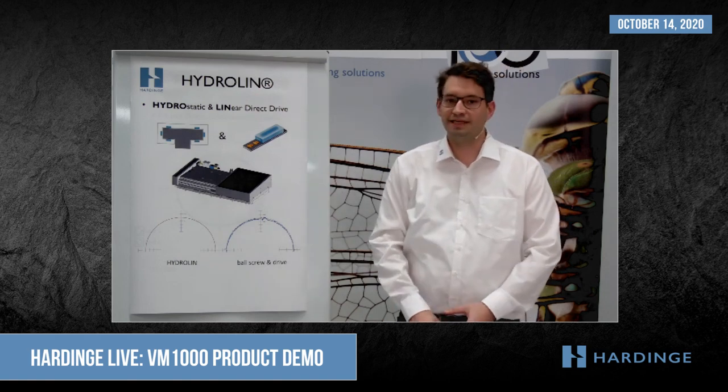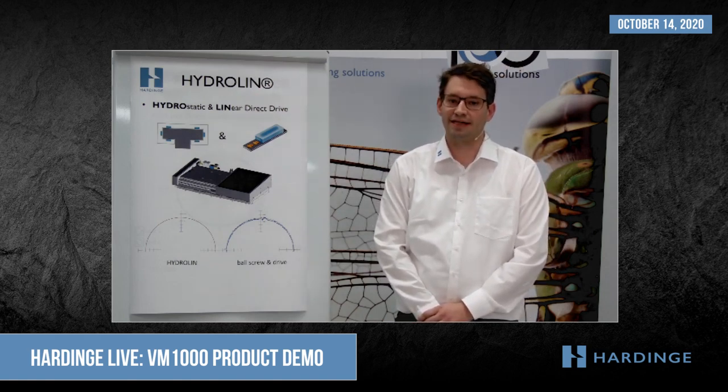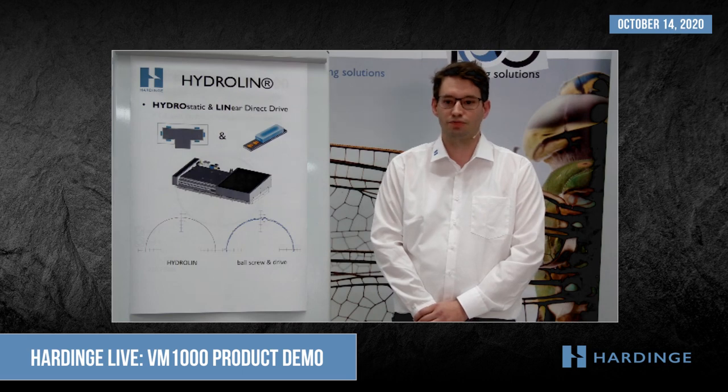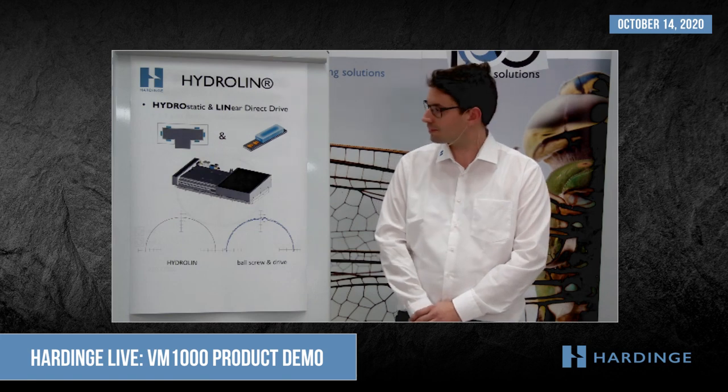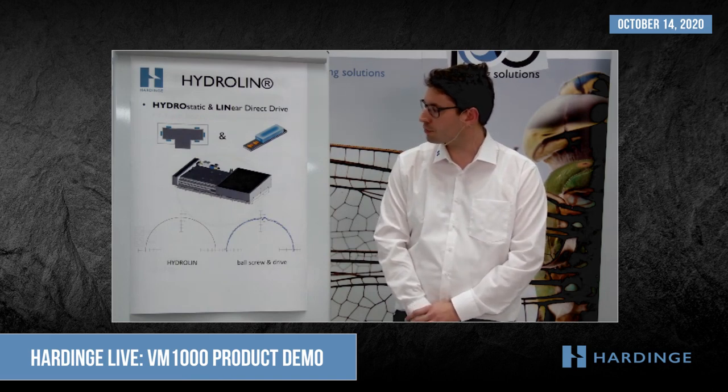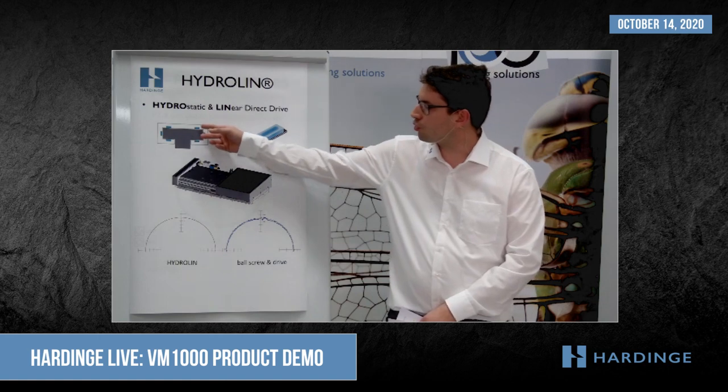Now to the wording. What sticks inside Hydroline? That's first of all the hydrostatics, and on the other hand the linear axis, the linear direct drive. To these key technologies, I will say a few words. First, the hydrostatics. Hydrostatic means that the movable sled of the axis is gliding on a small oil film, which stays under a constant or static pressure. That means that there is no contact between the sled and the static part. For Hydroline, the guideway is constructed as a wraparound, supported by controlled oil pockets that gives us a maximum stiffness of the unit and a very good robustness.